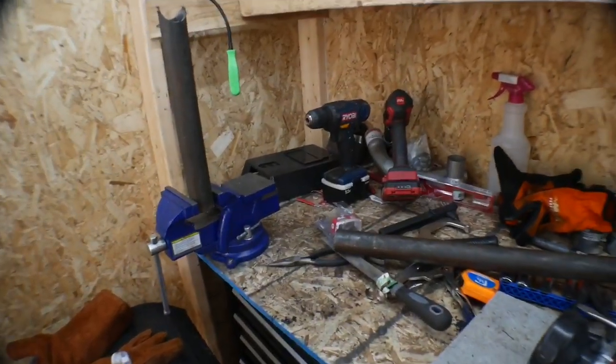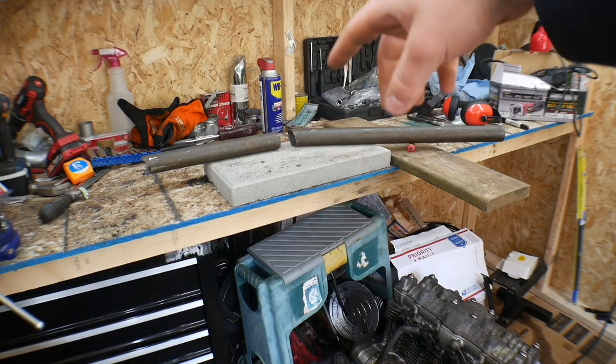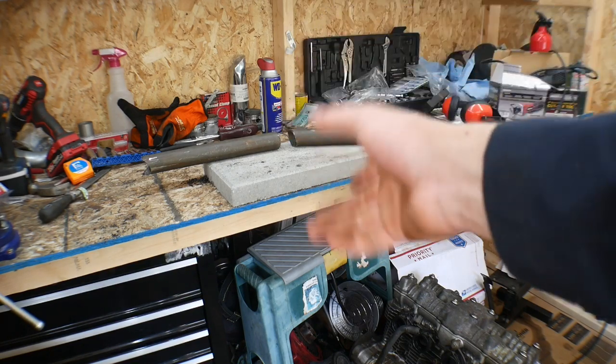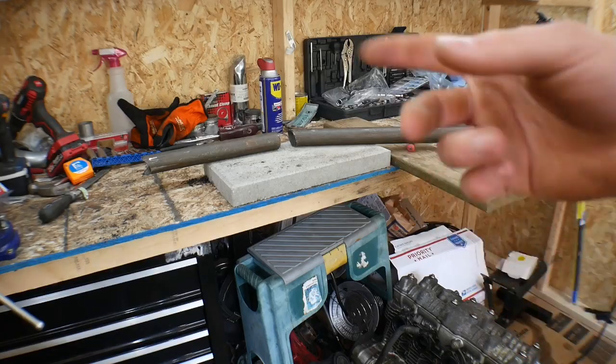Let's go ahead and turn on the welder, get on the welding gear, and I'll weld them up in the vise first, then weld onto the frame. What I'll do first is take out the big grinder, grind everything clean to shiny metal, then tack it up, pick it up, put it onto the frame to make sure it's all good, and then fully weld it.